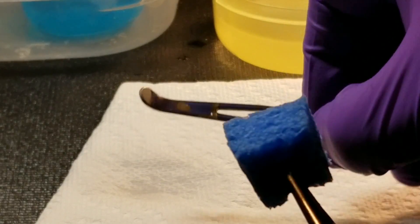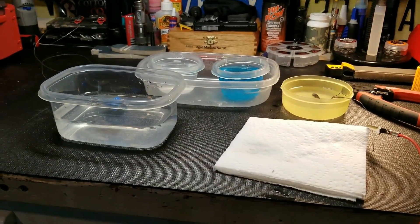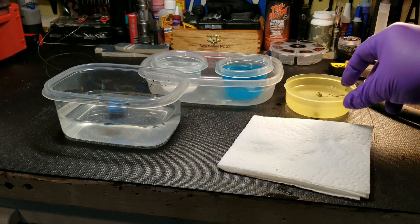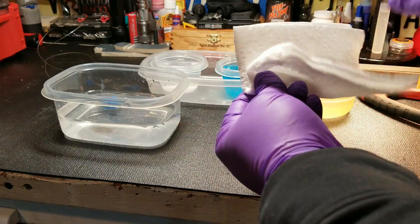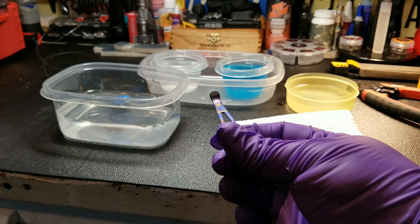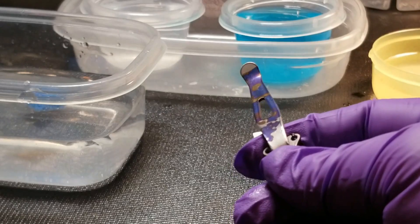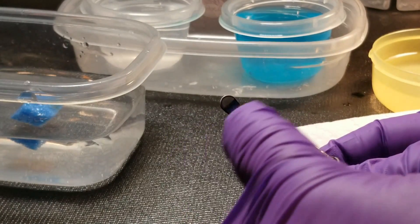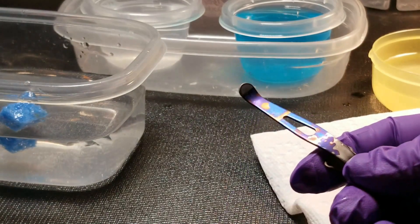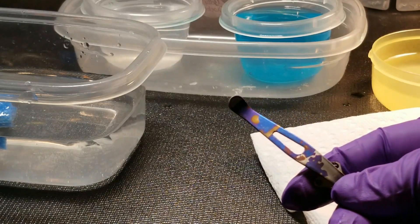You can also throw it into your bath there. This method is good if you don't want to anodize the whole thing or you want to make crazy patterns. You can actually take electrical tape, put it over the top first, cut stuff out of it, then go over it with the sponge — you'll be able to etch different designs into your piece. Just a little trick I wanted to show you guys.